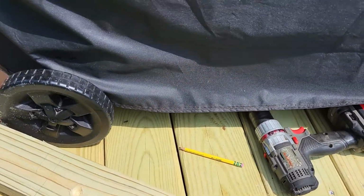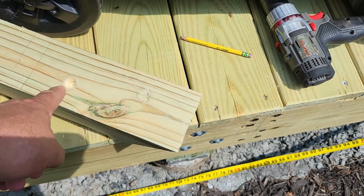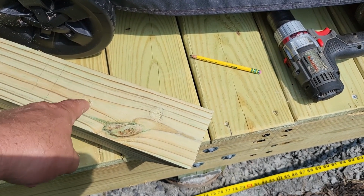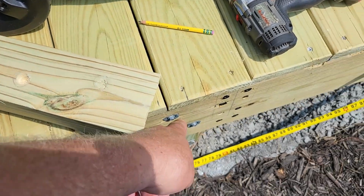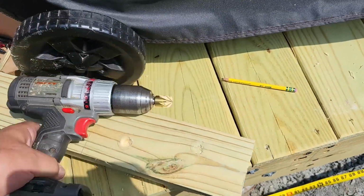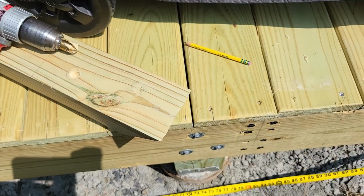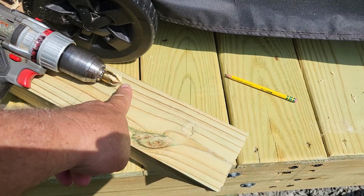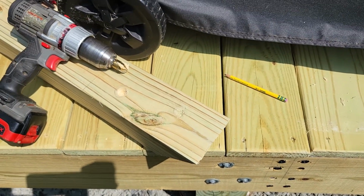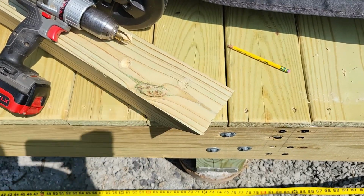So by hammering the mallet, the post against these screws, it shows me exactly where they're located. So when I put in my lag bolts to hold this post in place, I need to gouge out where the heads of this will go into here. So by doing that, I'm just using a countersink. That's it. Gouge that out. And then I'm gonna pre-drill my pilot holes here so I know where to go so I don't hit those. And that's it. It works. So let me finish getting this set up.